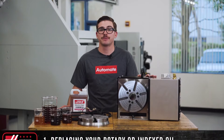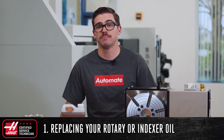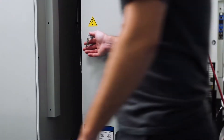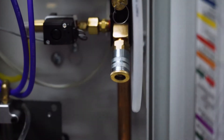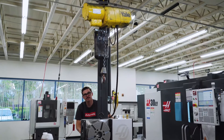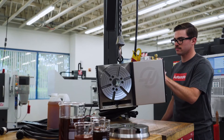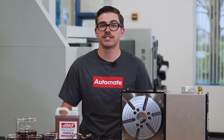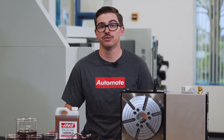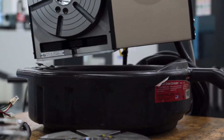The rotary I've got here has been running for two years and is due for an oil change. Before starting, make sure the unit is stopped, upright, and unplugged from the machine. Ensure that the pressure has been bled from the system by disconnecting the airline from the machine before proceeding. Position the rotary over the edge of the table or suspend the unit using a crane or hoist to where you can access the bottom of the oil drain plug. If you have the unit set on a table, make sure it is properly strapped down to avoid injury. Place a container underneath the rotary to catch the oil you're draining.